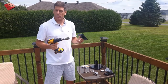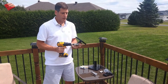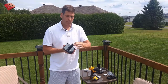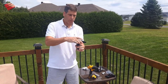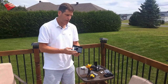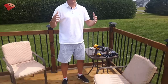One thing often asked is why the hole saw is not as long as the tube. This hole saw is a typical hole saw — an inch and seven-eighths actual depth of cut — and it's significantly shorter than the tube. That's intentional. The tube has a sharp inside edge and is designed to track into that pilot cut once you've squared it both vertically and horizontally, and impale deep into the post so the wood fills the inner cavity. Then you pre-drill, drop in your legs, and you can literally surface mount this and locate with complete freedom where you want those posts.